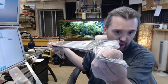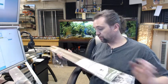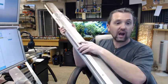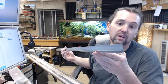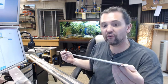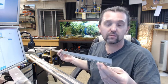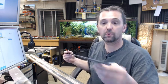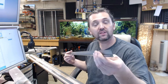Screws are included in a complementary finish. Plenty long, 2.5 I would say at least. And that's obviously for getting down through this very tall portion of the threshold. Now the hook strip itself, and these are replaceable, and people end up buying these because over time, well, they will fatigue, but I only see fatigue after decades of use, or they're unintentionally damaged. Someone puts a rug in front of the door and the door is opened and it gets ripped, is the bottom line. You can buy these separately. It's not a big deal.